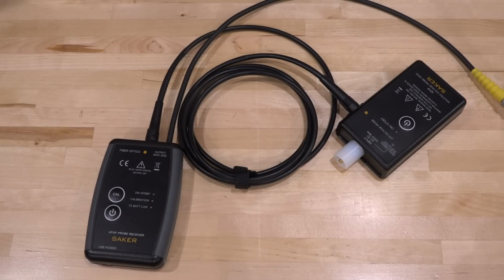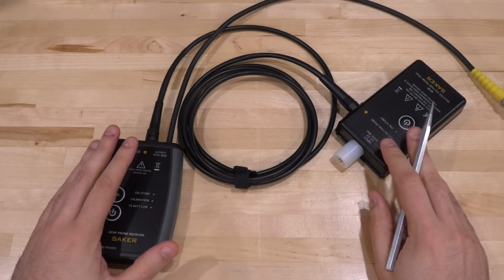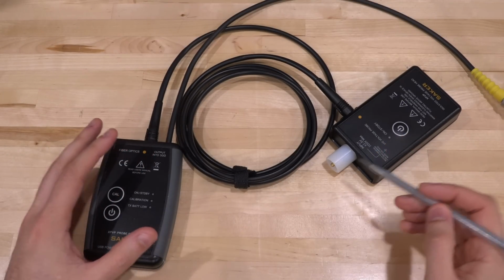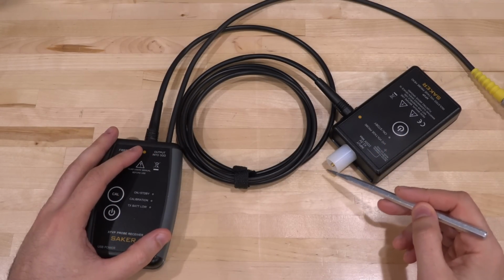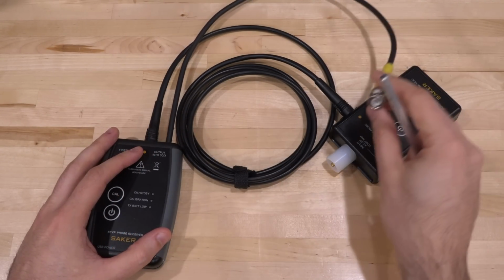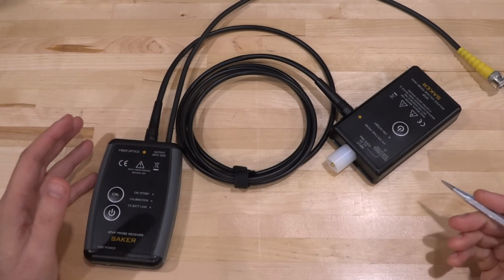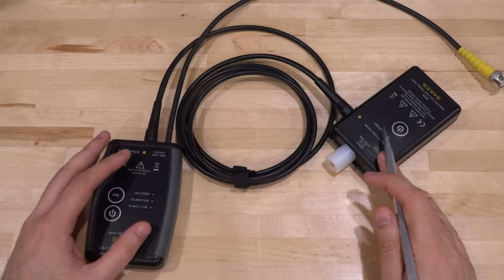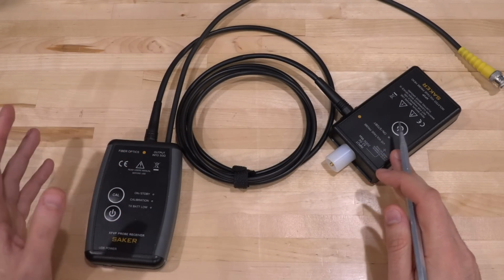So we see these kind of features all the time, but what makes it difficult to put in a probe? Well, in a probe, what we're trying to optimize is very different. We want to basically reproduce the analog signal appearing on one side to end up here with as much fidelity and linearity and dynamic range as possible. That's not necessarily what we're worrying about, let's say in an opto-isolator or even in our telecom industry,